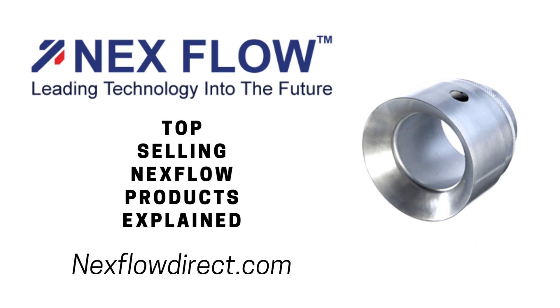Because of the high velocity and high mass flow, that velocity will cut through a heated surface's boundary layer, and with the mass flow, remove that heat much quicker than many alternative blow-off systems, like blowers, for example.